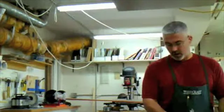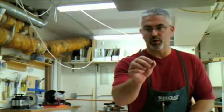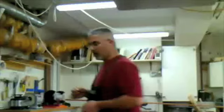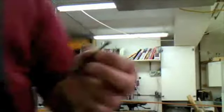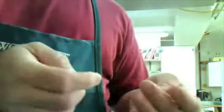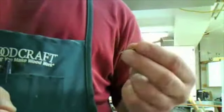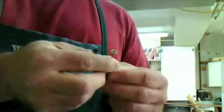But more often than not, what I end up doing is just using screws. You can't use any old screw for putting particle board together — regular wood screws don't have deep enough threads and won't hold very well. At a minimum, I would suggest using a drywall screw; you can get these at regular home centers and they work pretty well and are inexpensive. You'll also often find a general purpose deep-thread screw at different home centers, and I've used both of these in the past.